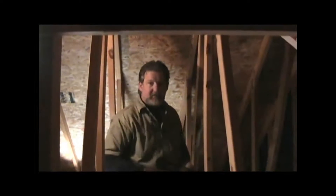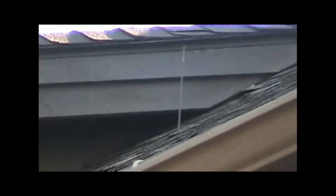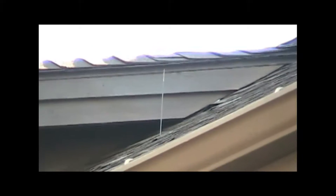Now the rain has cleared off, so we're back to finish the roof penetration and get this system finished up. I'm going to run a pilot bit up first and go outside to see if I can see that from the ground to make sure it's a good location for the vent pipe. We came down in the yard next door and were able to see where the pilot bit is — it looks clear of the soffit, and the pipe should stick up a little above where the other roof joins in, so no concern about noise being reflected or moisture collected on the soffit. We're going to get our template that has markings for different roof pitches to center the template. You can see our other eave comes out to just the other side of this 2x4, so we're several inches from there and the pipe's going to be a little bit above it.